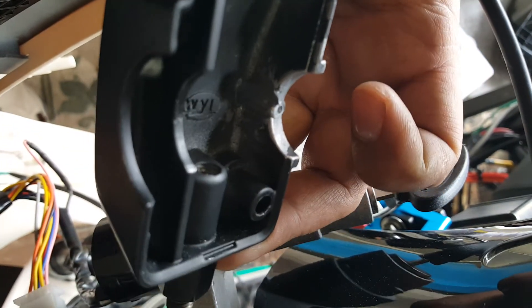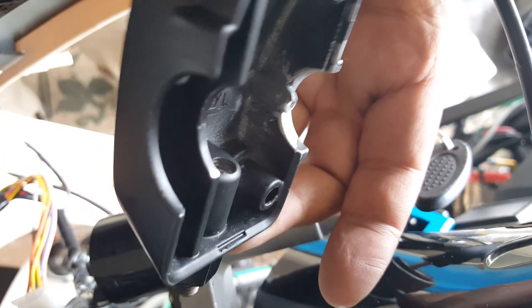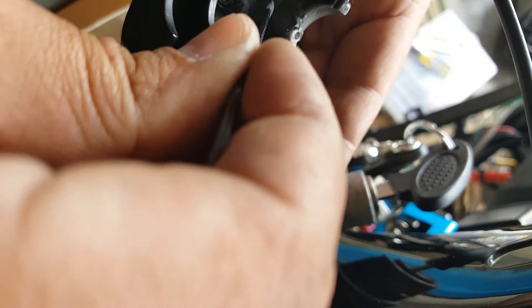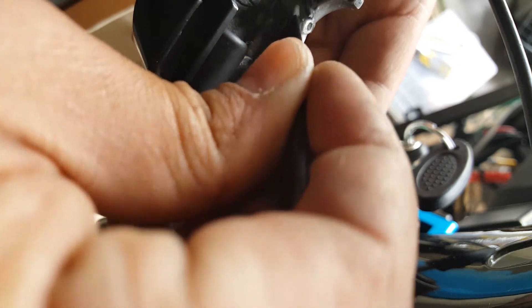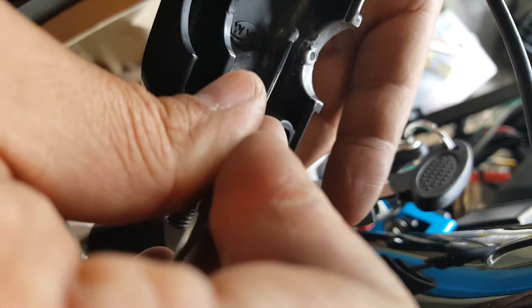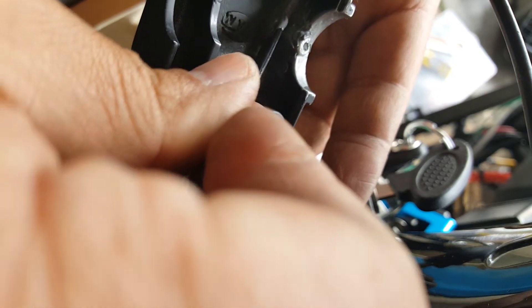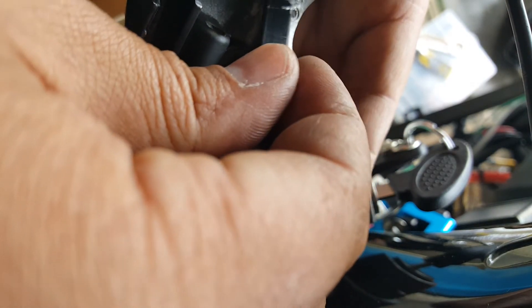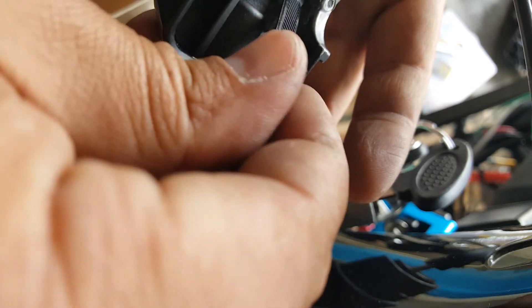You can do a pretty job once you get all that filled into the crack. My JB Weld job there — not too shabby. Sorry, poor lighting. It's gray on gray, but yeah it'll build. You'll definitely get it to build. It's starting to get hardened now. You want to layer it a little thicker in the areas that are vulnerable. That way you know you're building up — sort of like clay. You can see I'm trying to build up that corner here, trying to create almost like a hillside or a ramp, because I want it to harden right in that area.